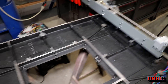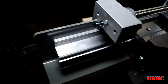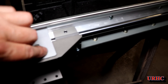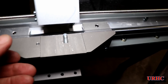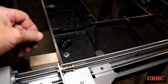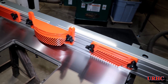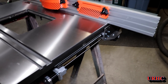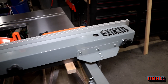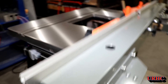The other side is pretty much the same thing mirrored over. I set these up with indicators so everything is perfectly in line and moving straight. I made it so you can unlock the fence from the lead screw just by taking the knob off and sliding the fence out of the way for large workpieces, then everything locks right back together to re-engage the lead screw. The feather boards finally came in from Peach Tree, including a nice safety one in the center. The vacuum hookup is right there where the hose will tee into the one up around the router.